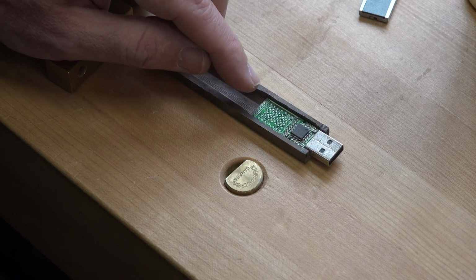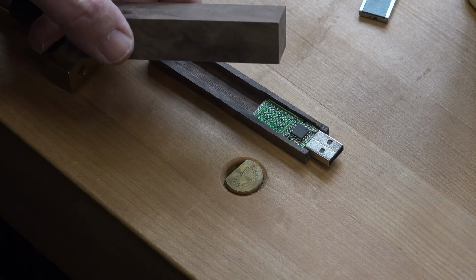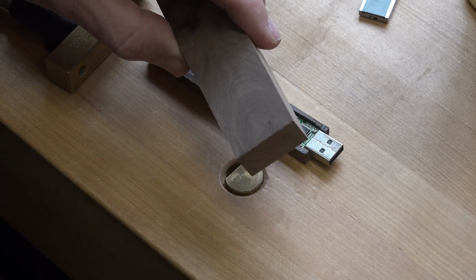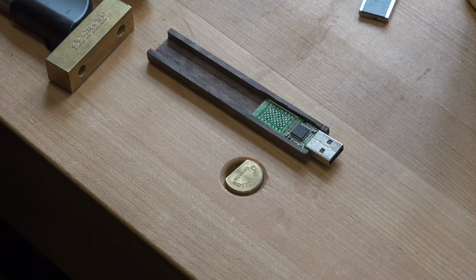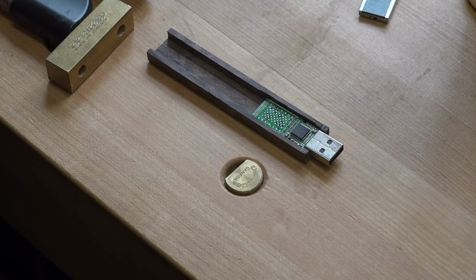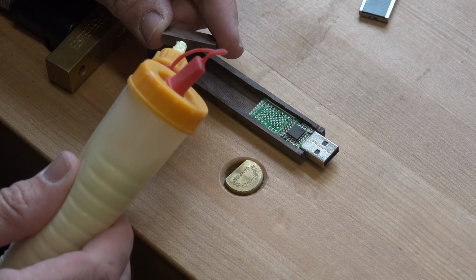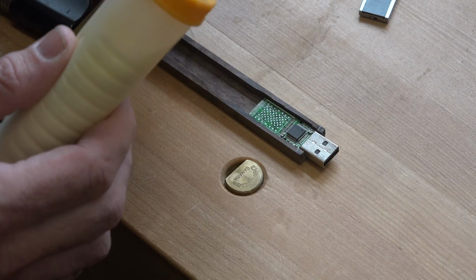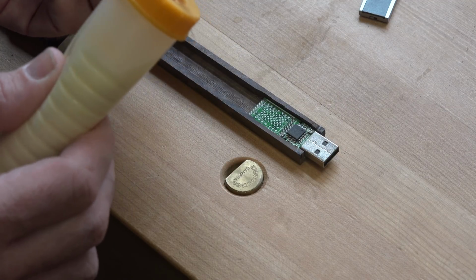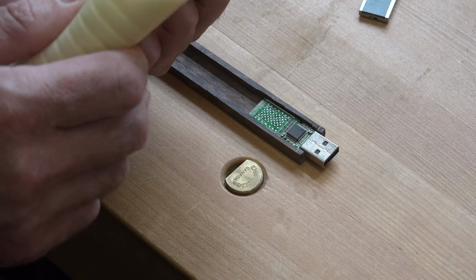So take a measurement of the inside of this very carefully from the same stock, because you should have offcuts here. So cut an end cap plug to go in the end here for gluing into place. And with our end cap cut, we're just going to apply a little glue to 3 of the 4 sides. We don't want any on the top of it just yet.